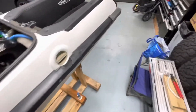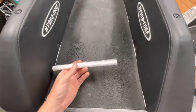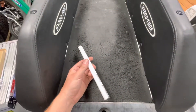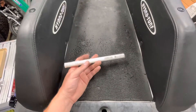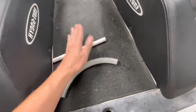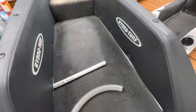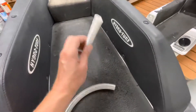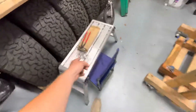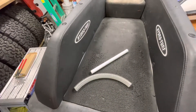I used half-inch PEX, which is half-inch inner diameter, and half-inch brass barb couplers. Half-inch barb couplers don't go into PEX but they go into the coolant lines, so what I did is I took the half-inch barb coupler, threw it on my drill press over there, spun it around, and sandpapered it with some 200-grit sandpaper until it fit in here perfectly. I did some clamps on it and I think it should work real nice.